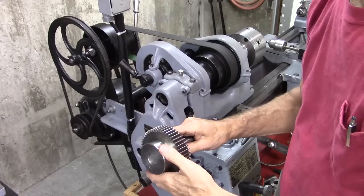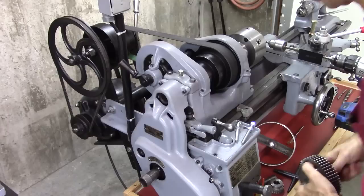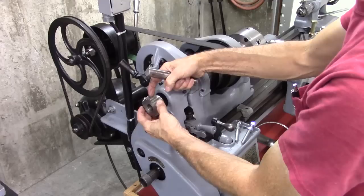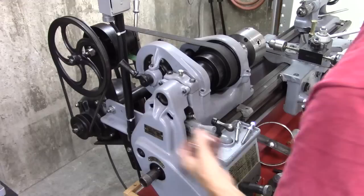You could use change gears. Any 48-tooth gear doesn't have to be that big — that's really overkill, I just got a good deal on it. Here's a 24-tooth. You could get just about all the same combinations with it. Having a gear that small, the resolution is not quite as good, but that would probably do just as well.